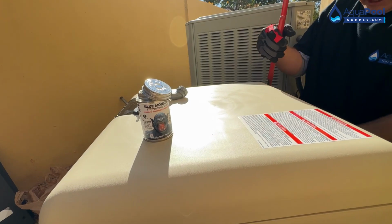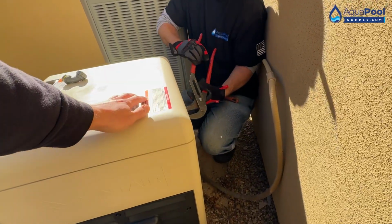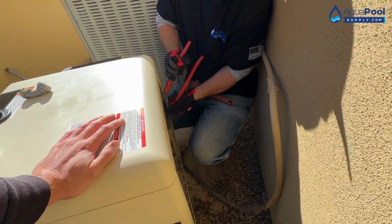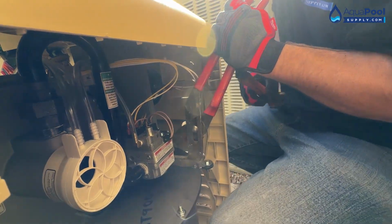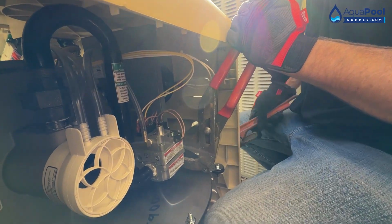And when you go to do this gas line into the gas valve, I will use my channel locks to hold on to the gas valve itself to prevent it from rotating, so that you can get a proper seal on your inlet pipe.